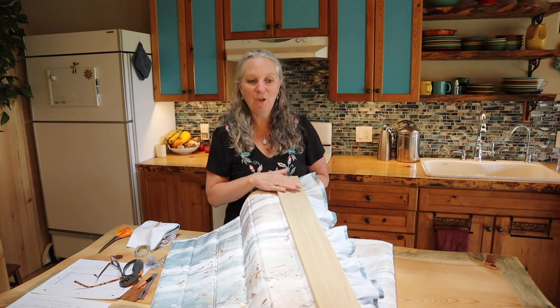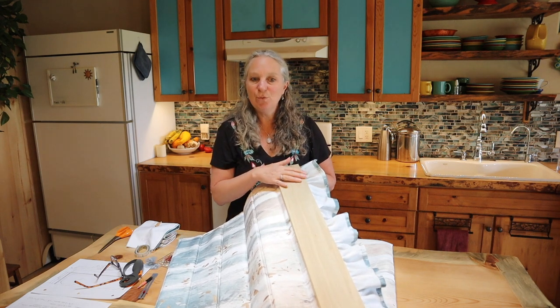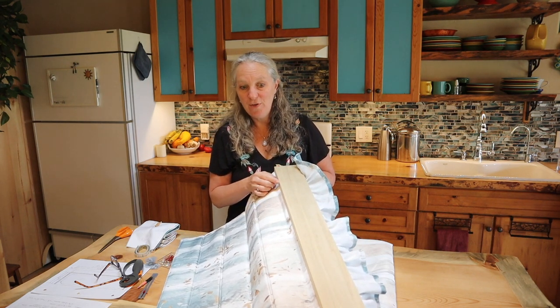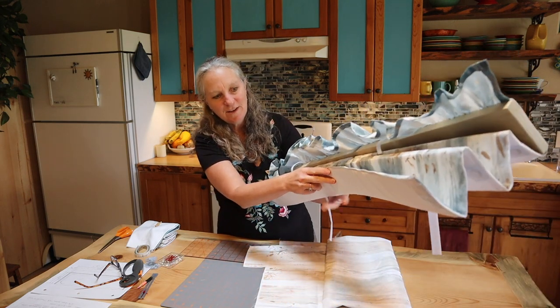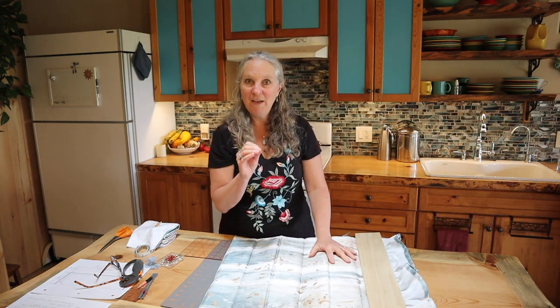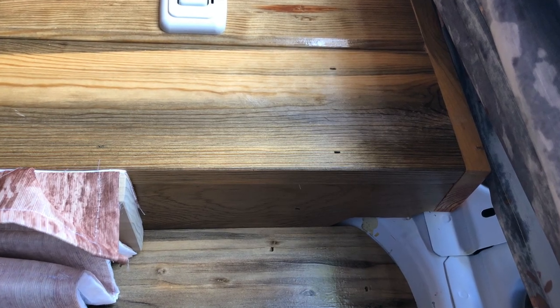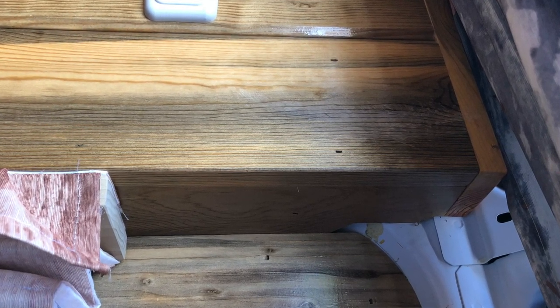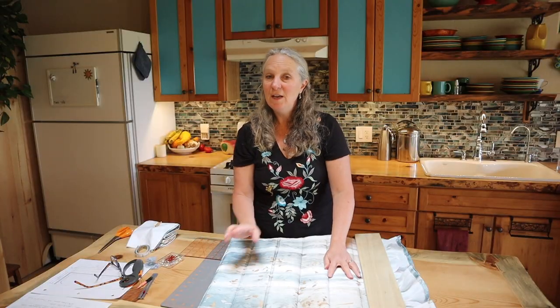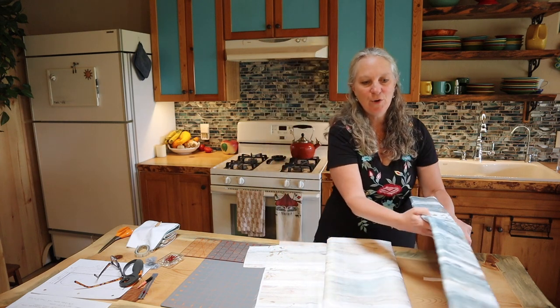So in the case of this blind, this is going to be mounted underneath cabinets that are pretty deep or wide and they stick out. So we could make this any size we wanted. We're making this 3.5 inches wide and it's 3/4 inch thick. So as you can see, that's what determines the width of the panels so that they stack nice and tight. On the blind that we're making this time, it's mounted in a different way. And it all depends on the framing and how you framed out your windows. In this case, we only have 3 inches, so we have to make this top piece 3 inches, and then that determines the width of the panels for this next one. So in this one, they were all 3.5, and the one I'm going to show you, they're going to be 3 inches. So you want to have that figured out.